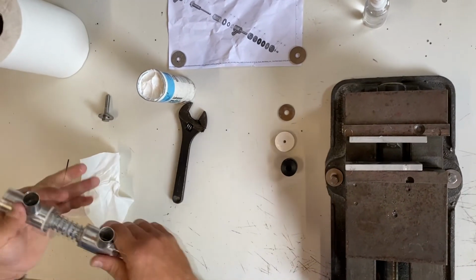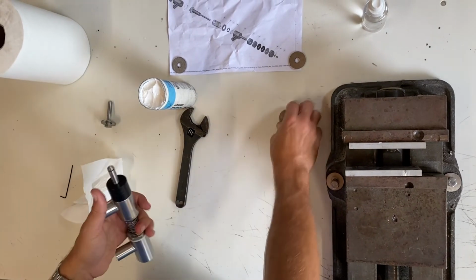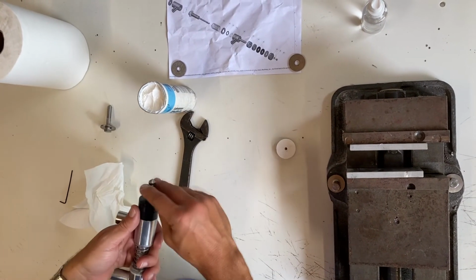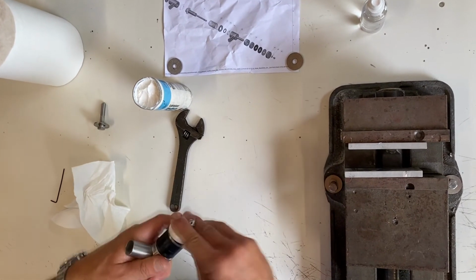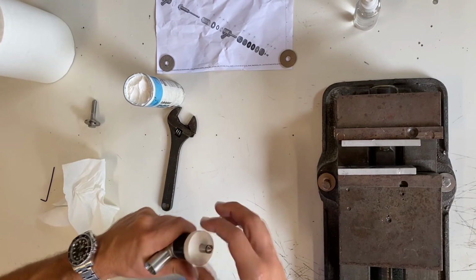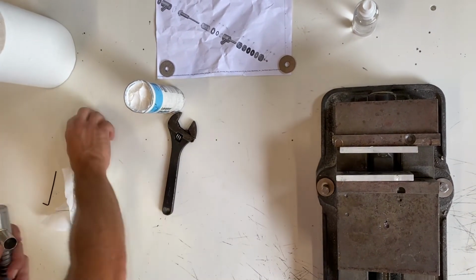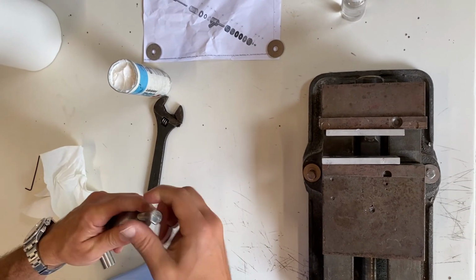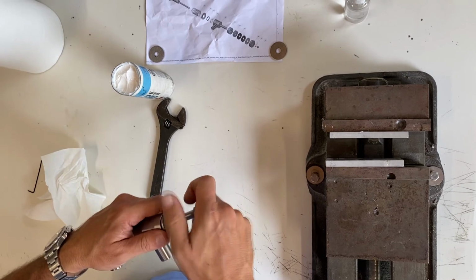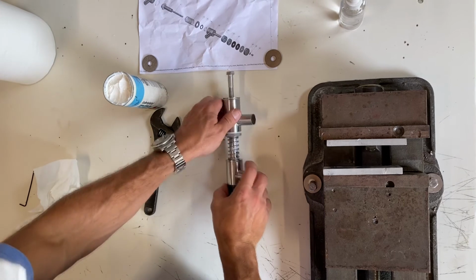Afterwards, you only need the spacers. It's going to give you your fill level depending on the quantity. Then you put the washer to give some rigidity to your sealing gasket. We make the sealing gaskets different sizes depending on your application. And if you need a mounting screw, you can just get it in there. This is a 3/8 24 thread. And that is your nozzle.